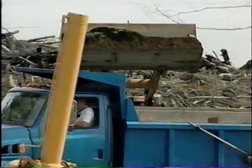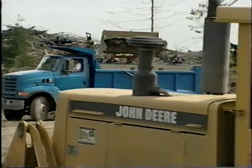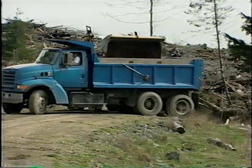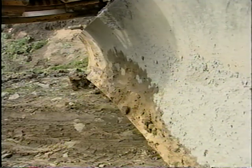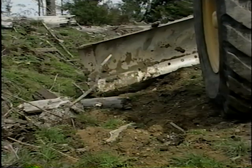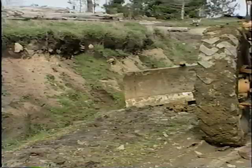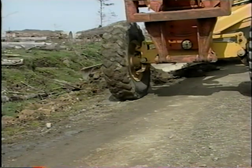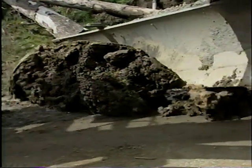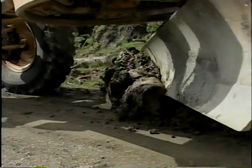Pulling the ditch involves the actual removal of accumulated soil and debris. This procedure is performed lightly and selectively, removing only waste material needed to restore the original ditch template. Position the toe of the moldboard over the portion of the ditch furthest from the road. With the tip touching the bottom of the ditch at the flow line, rest the moldboard cutting edge lightly on the side of the ditch closest to the roadway. As the grader moves forward, the toe of the moldboard should follow along the flow line to capture mud, wood, silt, and other accumulated materials. The cut should only be deep enough to restore a smooth flow line and make the ditch bottom uniform, allowing water to flow easily along the ditch bottom.